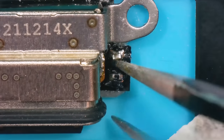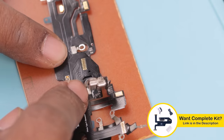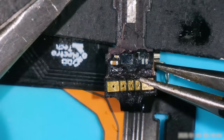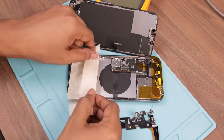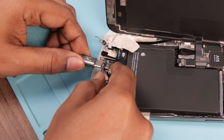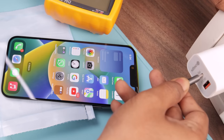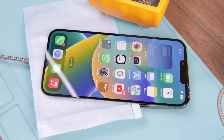After soldering, I took the flexible PCB and placed it on the charging flex, carefully positioned it above the lightning connector, added a bit of flux, and soldered it. Then I soldered both sides of the C91 board onto my custom flexible PCB. I covered the metal part of the body to avoid short circuits, attached the charging board, screen, and battery to the motherboard, then connected a USB Type-C cable. But the phone didn't start charging — even after reversing the cable, it didn't work. So I disconnected everything.